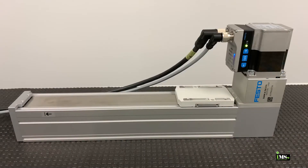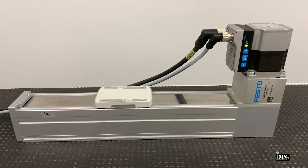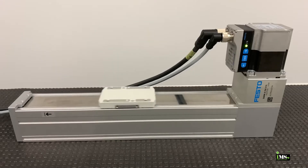In this second part of the video, we will commission the tooth belt actuator from factory settings. When SMS actuators arrive from the factory, the dynamics are set to the lowest settings, which look like this. This is the slowest speed this tooth belt actuator can move.